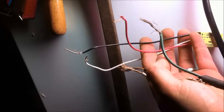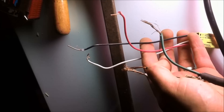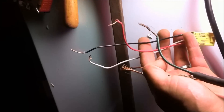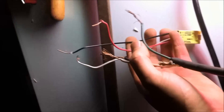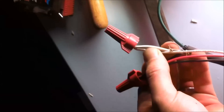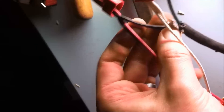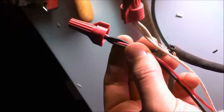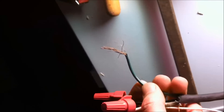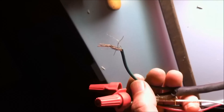And then your green ground wire hooks to the green screw on the top of your lamp. Make sure your wire pops out somewhere near that screw, or you can just stick a screw in the top and hook it up to that — it doesn't have to be the same green screw. Your two white wires are spliced together with a wire nut on top. Your black wire from the fixture is spliced to both your red and black wire from your new light. Hook the green ground wire to the green screw, otherwise you'll probably get electrocuted.